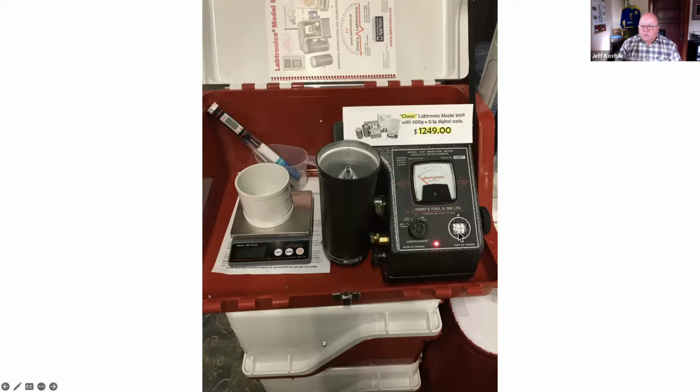The calibration, though, is where it slips up a lot of people. For other crops, you can see it's sitting at about 53 here in the bottom right-hand corner. When you're calibrating for hemp, the calibration is at 73. So a lot of farmers will be out at least 2 percentage points, which could mean disaster and or unsafe product. So always make sure, read the owner's manual, as they say.